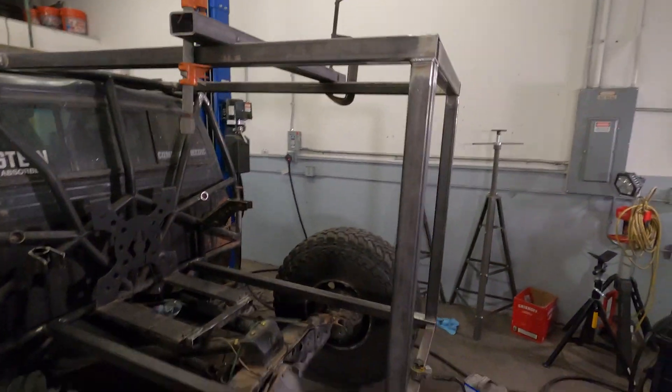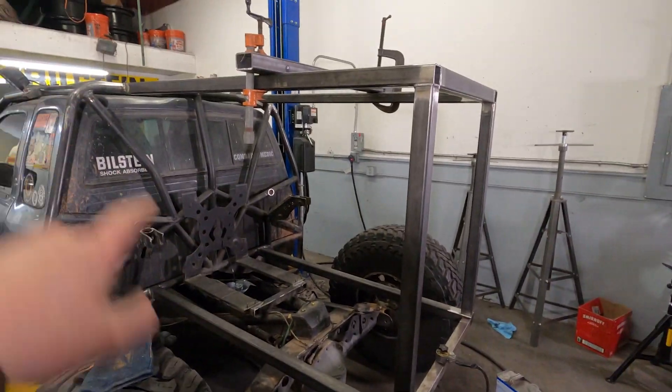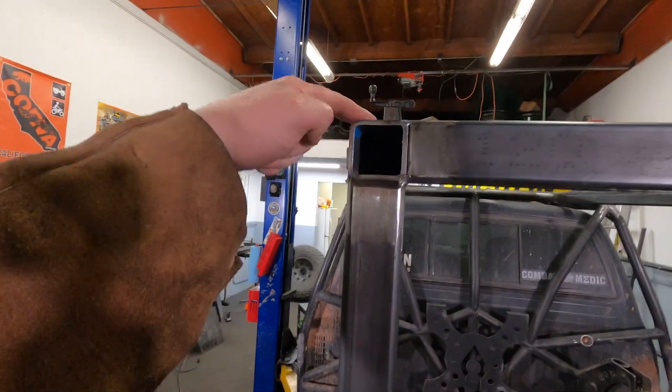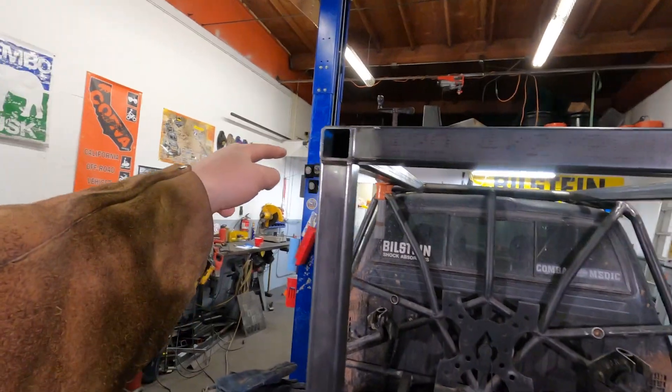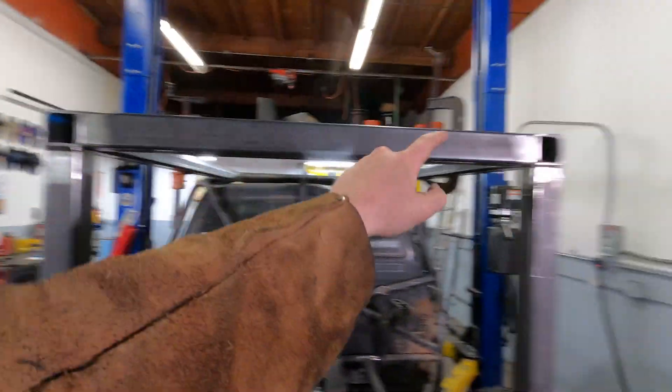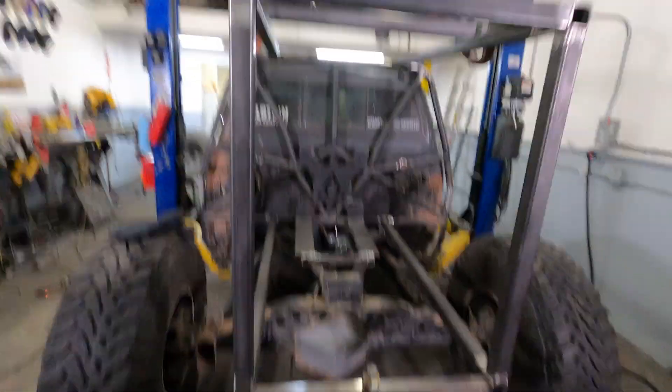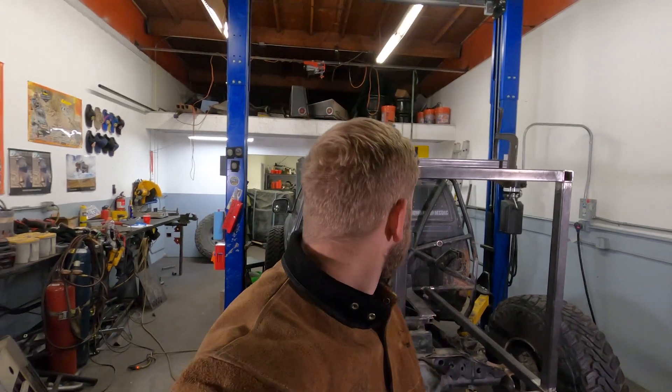Once I start adding some weight back here, since there isn't a lot of actual structure, I'll need some X-bracing and stuff — that'll come later with thinner material. This two-by-two is actually totally overkill for the top; I should have used like inch-and-a-half 0.120-wall for the top and only used the thick stuff for the bottom, but it's what I had. Anyway, I'm about to break the cardinal rule and just burn it all together.